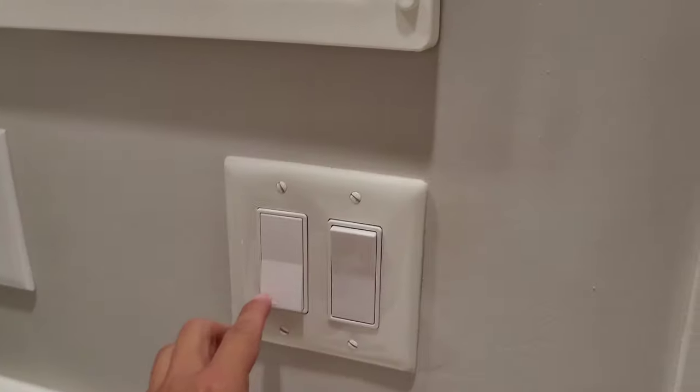So what I have in my bathroom upstairs is LED recessed lighting. You can see in the off position, it has just this very faint glow. And if we look at the switch, which is an illuminated switch that I put on, it's in the off position. This is the on position. And as you can see, it's bright and it's perfect and it's fine, no problem. But when we turn it into the off position, we have a little bit of residual glow.